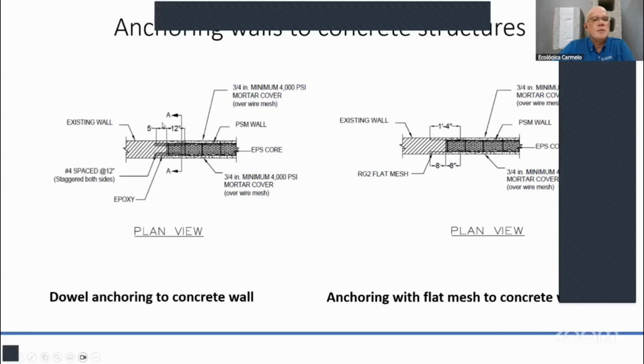And in this case, they put, let's say, a foot or so right into the existing structure. Okay, and that's the way you'll be putting your rebar on it. And then these rebars are going to be staggered in that wall, in that structural wall. And this picture on the right is the panel. So you'll be putting your panel here, and let's say if it's the wall, that's how you connect there.